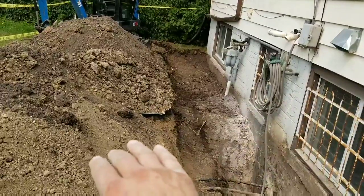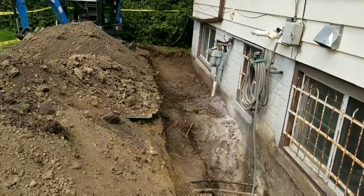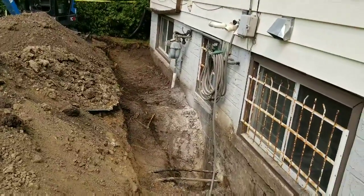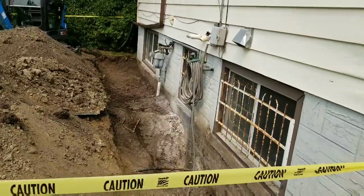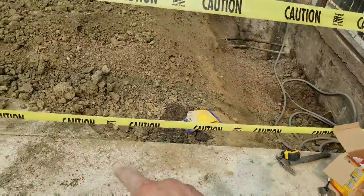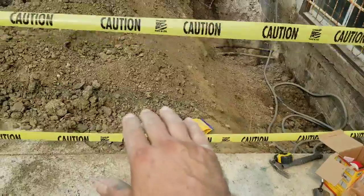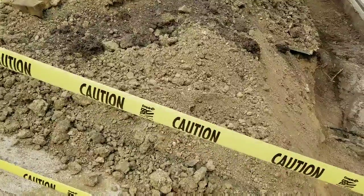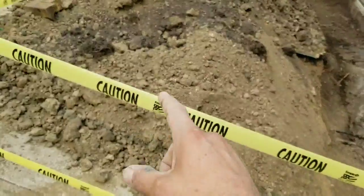And we're going to shape it for 4 feet out away from the house. And then on top of that, we will put soil, and then we'll put sod. I never recommend planters against a house, because that'll just keep water up against the house. You can see on the patio here, I actually cut out a big chunk of patio to clear more space to allow us to grade it out. And very likely I'm going to put a drain line that runs along there to give it something that it can collect water and push it away from the cement and drive it over towards the lawn.